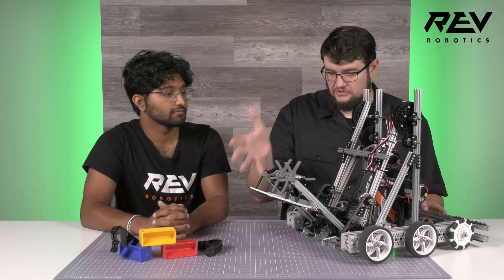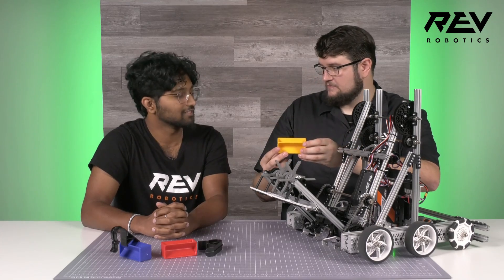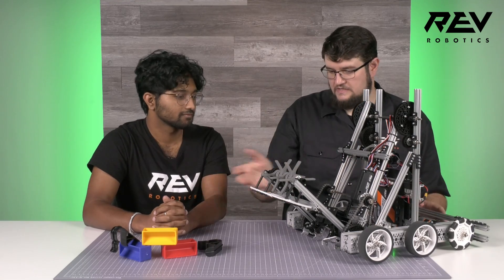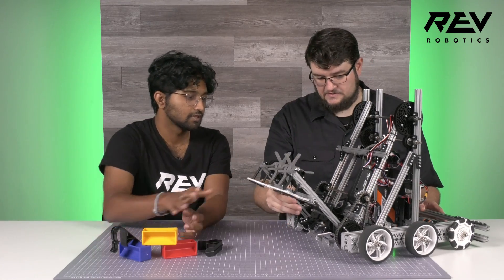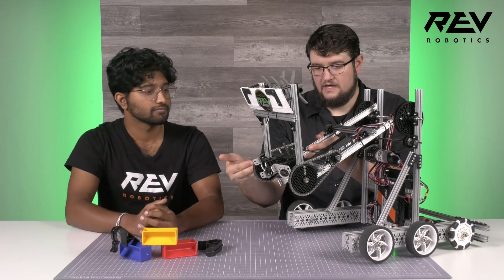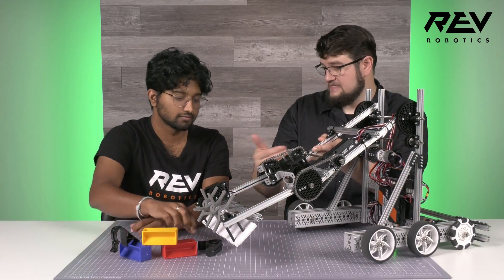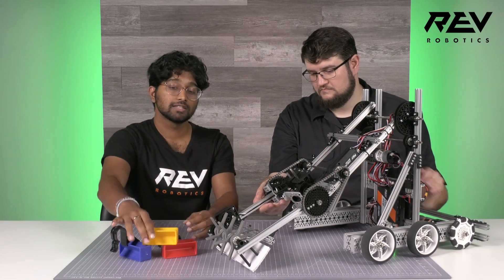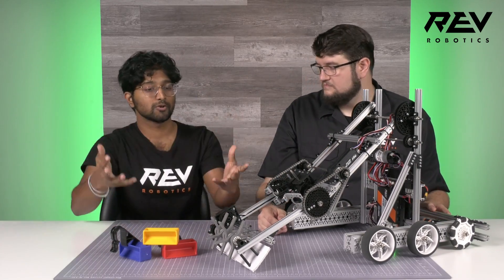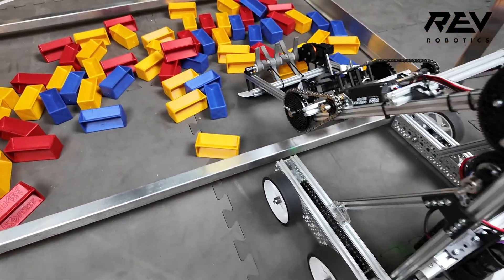Planning around intaking this piece, because of the odd shape, we treated it really as a cylinder initially. This intake is now on basically a wrist component that is able to fold out of the robot. One of the really interesting parts of this year's game is that the samples are cordoned off in their own area in the submersible, and in order to reach over that two-inch wall, our robot was built with an arm and pivot on the wrist to reach over and intake effectively.